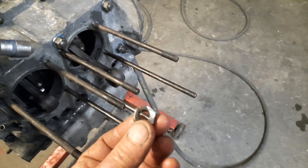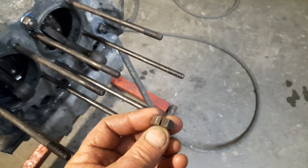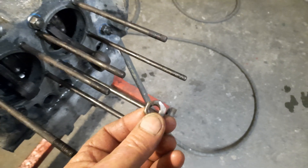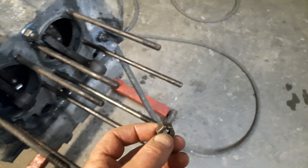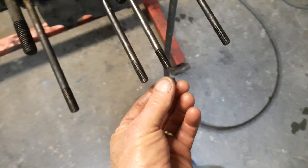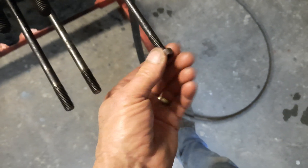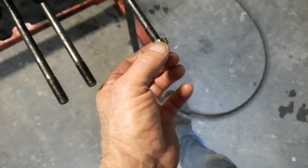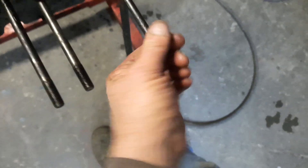I've done this before. It's pretty simple — you just get a spare nut of the right thread, get your grinder out, just cut a slot in it, and that is plenty good enough to clean your threads. You've got to get the air and blow out this gap after each one.